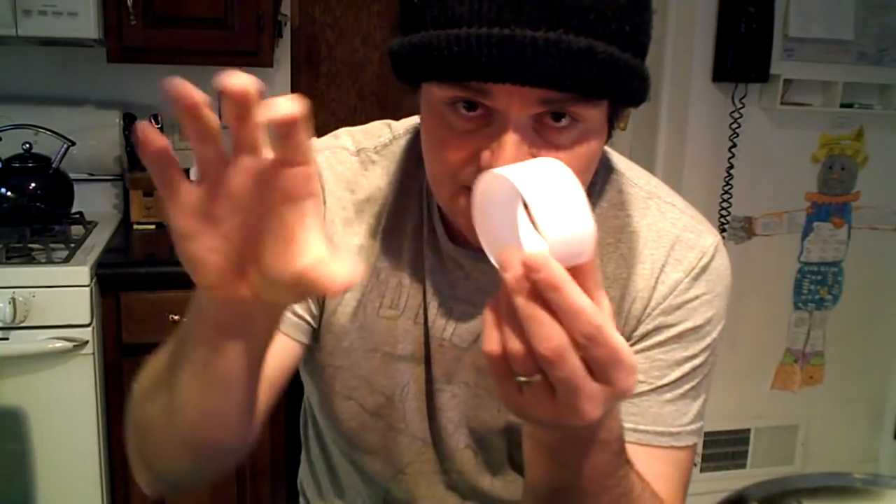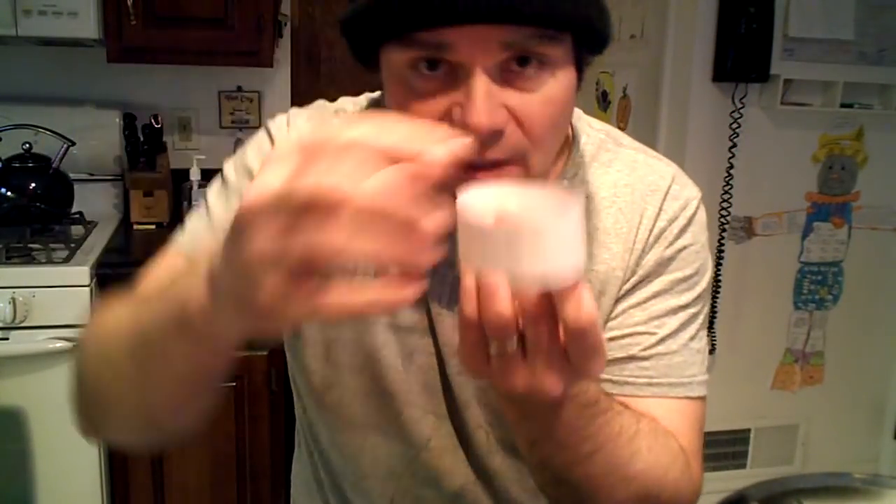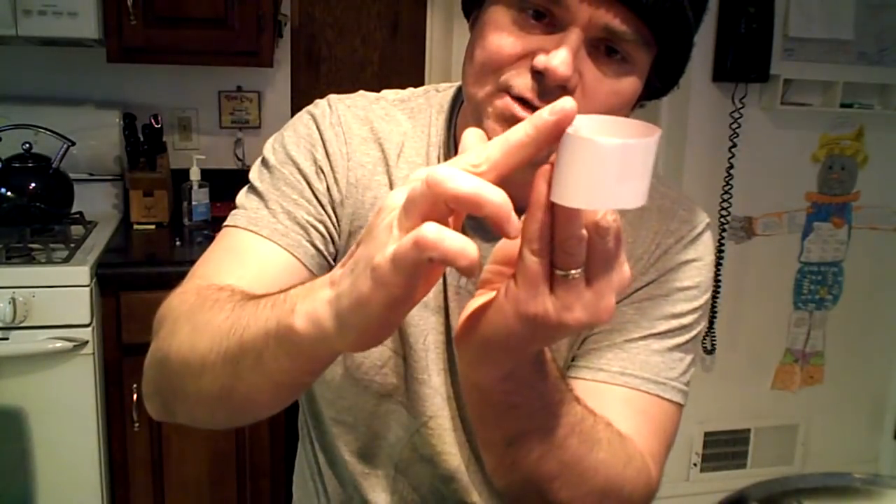The ones after that, which are called spun shells, can be brass, aluminum, bronze, or whatever material you want. They start out as a cylinder of metal cut into chunks, put into a die or centrifuge of some sort, and it spins around. Under some heat, they shape it — almost like pottery on a wheel — uniformly distorting the mass. As it spins, you shape in the bearing edge, which results in a flange, then the bead and everything else.